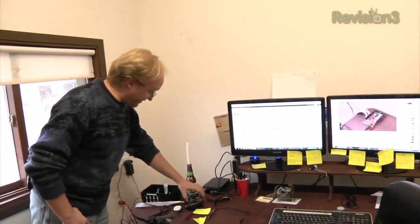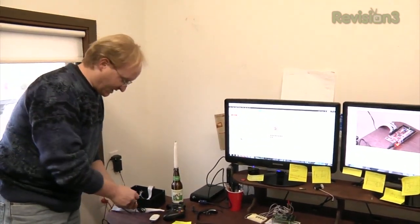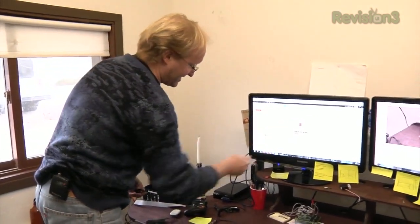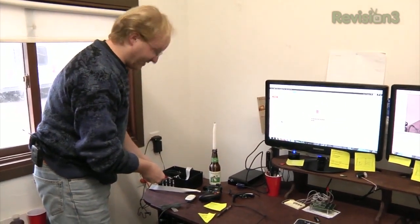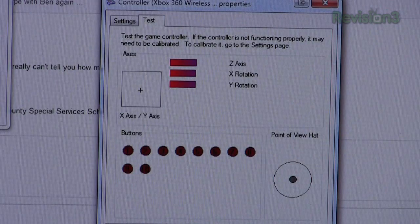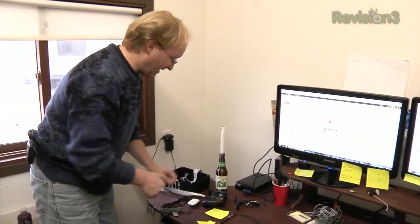The next step is to hook up the multiple input jacks for the external switches and make it so clicking a switch will execute a macro with the main face buttons. We've got it plugged into the controller and I've got a macro running. There's going to be an external foot pedal switch hooked up using a jack. I'm just going to hit this with my tweezers — which simulates a foot pedal or accessibility switch — and it'll do a complex macro: up, up, down, down, left, right, left, right, B, A. So now you have 30 lives. In the next step, we're going to make it so you can push a button, click the switch you want to program, do the macro on the controller, and it'll store it on the EEPROM.